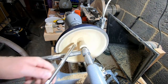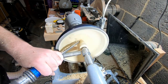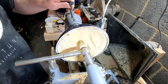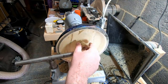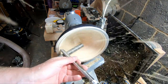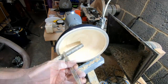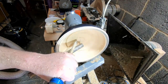With the bulk of the material removed, I whittled a piece in the middle down to a point where I could just remove the tailstock and snap it off. The tailstock restricts access into the bowl, so with it removed I was able to use the bowl gouge to do a cut from the rim down into the centre. A few times I lost the cut line and had to pick it up again, but eventually I got a few good continuous runs.